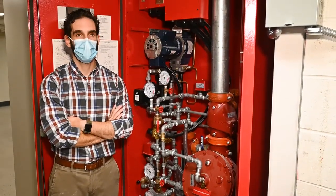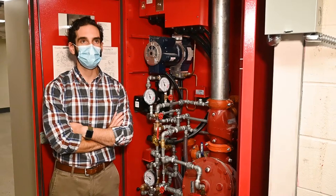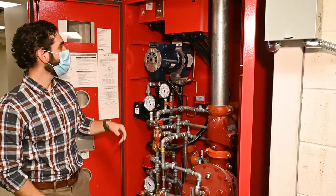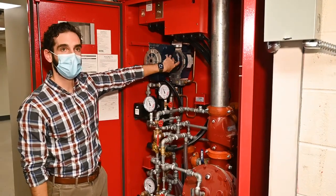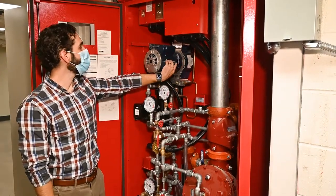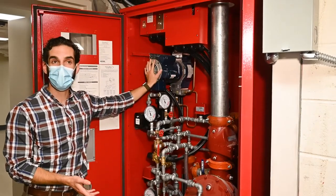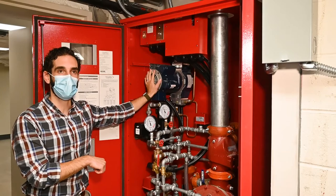So it's a normally dry system — you have air pressure holding it? The air compressor is right here in the cabinet. This is also monitored, so if this thing stops working and there is a leak, it'll eventually give a signal back to the control panel. If you don't have that, it'll flood the system.